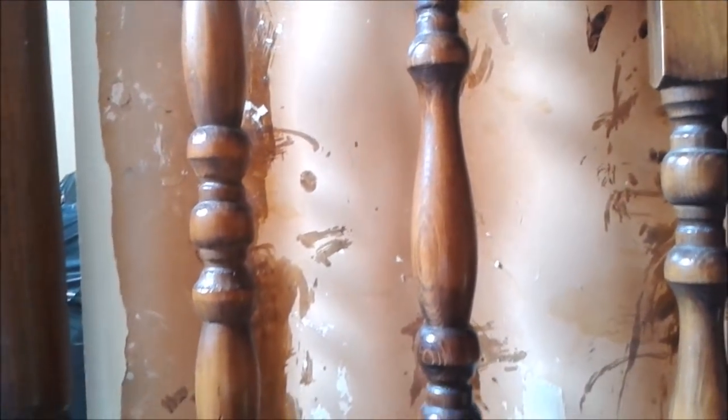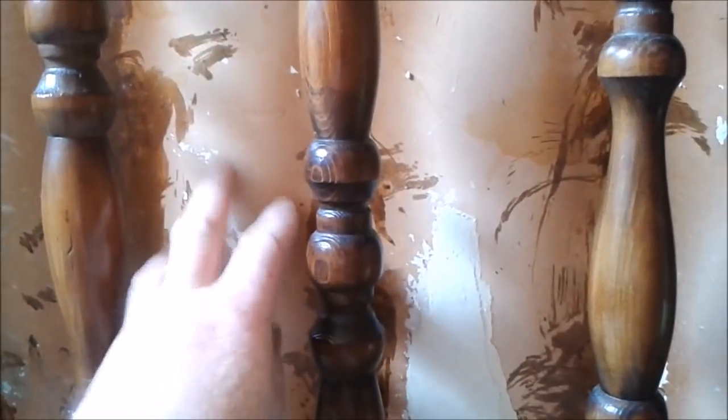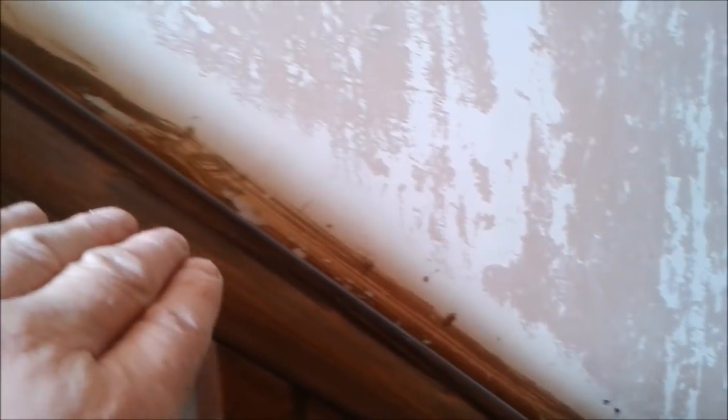But I think I might be able to get away with just painting this back. Get it all neat and clean and smooth. And then I might cross line. Well, I am cross lining. I'm just going to bring the paper to behind the handrail. And then what I can do is when I've put my first coat of paint on, there's a slight gap there. I can fill back up just to hide the shadow line of my paper, and that'll be right.